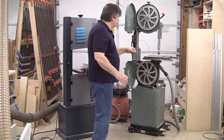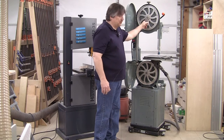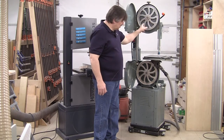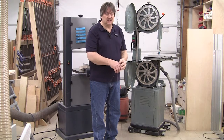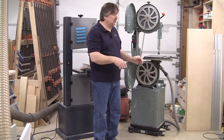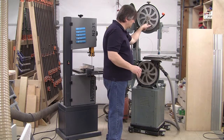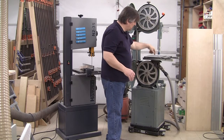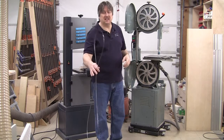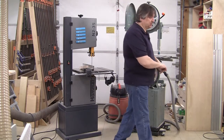And at that point they could set it up so that it runs around the two wheels on the saw. They could still attach it to the water wheel, so as the water passed by, it turned. Now, as the water wheel turns, both wheels on the bandsaw turn, and we get a continuous cut, and it's always in that down position.